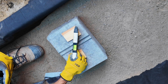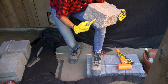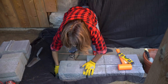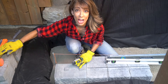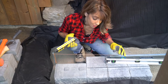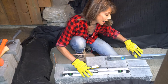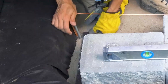After you do one, the other ones are gonna be more simple. When it comes to layout, I'm gonna start with this corner block — it has a finished face here and two finished faces on the side. I always like to start construction of a retaining wall on one side and work my way down. Once your corner block is set and stable, check for level, then move on to the next block. Check with a two-foot level as you go — side to side, front to back. Then get the big guys out: your four-foot level or six-foot level. Keep everything in line using your string line.